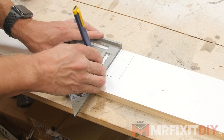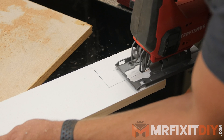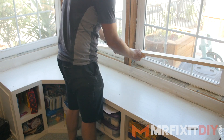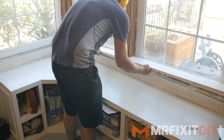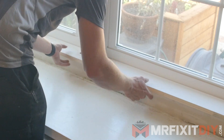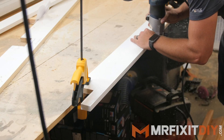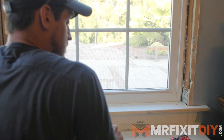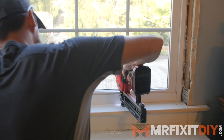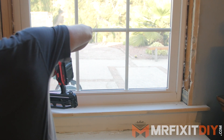The stool will stick out from the wall an inch and a half total. Take your time making these measurements and cuts so that you don't have any big gaps — it's better to cut it a little bit long and then creep your way up on it so you get a nice tight fit. Once I have the pieces fit, I'm using a quarter inch round over bit on my trim router to add a little contour to the stools. Then I'll install it by making sure it's level, both side to side and front to back. You may have to add a shim to make it level if it's not lining up for you. Once it's installed, I'm attaching it to the framing with some inch and a half brad nails.